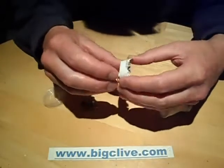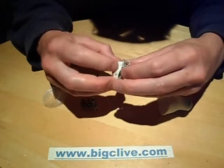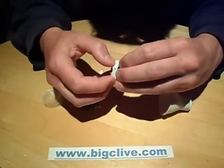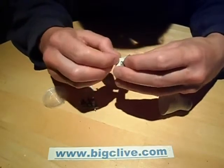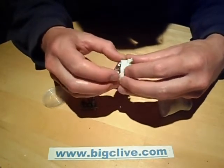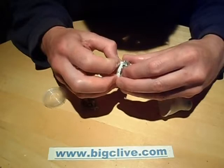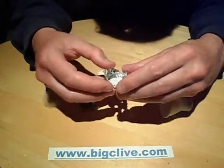The reflector is stuck in with a sort of thermally conductive glue, I'm guessing. It's kind of slightly not quite silicone-y, powdery — I'm not 100% sure about this. It's not brittle in any way. Initially I thought it was a double-sided foam tape, which would be quite hard to put in, but it's definitely a glue. It's squished about, so I'd guess it's a sort of silicone carrier for maybe zinc oxide or something like that as the heat transfer medium.